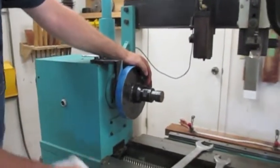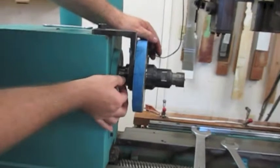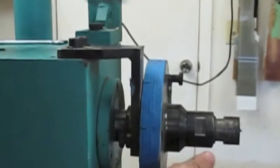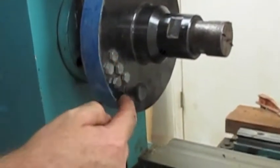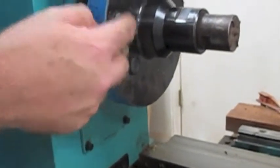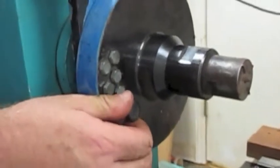This is an indexing fixture and how it is to be installed on the lathe. We have a bolt with a jam nut and also a washer behind it that's going to act as a spacer between the indexing fixture. It ends up getting tightened up on here. We have different bolt locations and there's a number on each of these — that number is the number of times that it will divide in a circle. This pin would be inserted into one of these other locations to get a different division of 360 degrees.